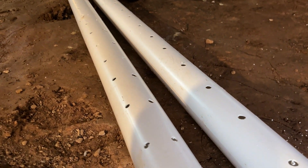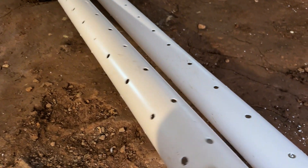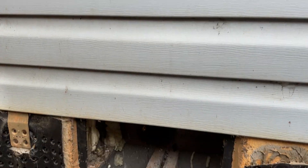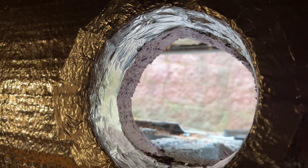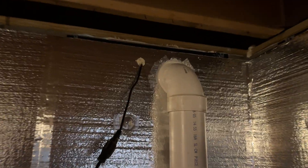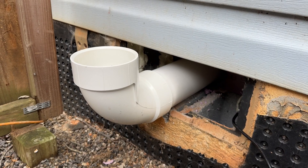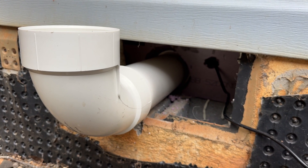This next step is optional, but since we do have a little radon here, I took a four-inch drain pipe and ran it all the way around the perimeter of the crawl space, making a T-joint, gluing all joints with purple primer and the corresponding cement. On the outside corner where one of the foundation vents was, I cut a hole through the foam board and two-inch rigid insulation to pipe the radon fan out. Here it is with all the final plumbing — I made sure to seal the top nice and tight so there are no air leaks coming in or out.